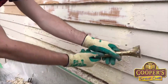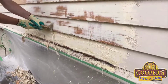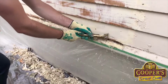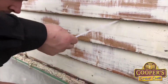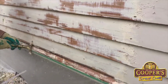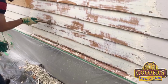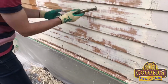You'll find that the paint has got different thicknesses. Typically, under the edges, it's thicker. When you're painting, as you take the paintbrush out of the can, the first place you put it is in there. It's out of the can, and boof boof into these parts. So these are usually thicker than the parts here. And also these parts here get more weathering as rain comes down over time. There's more and more wear and tear at those bottom parts. So we'll be putting on some more stripper.